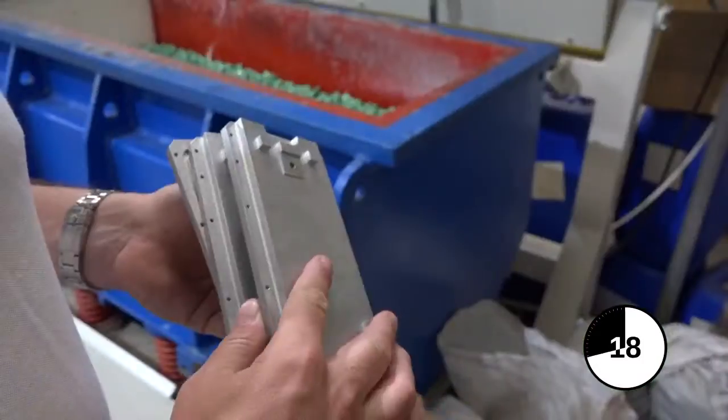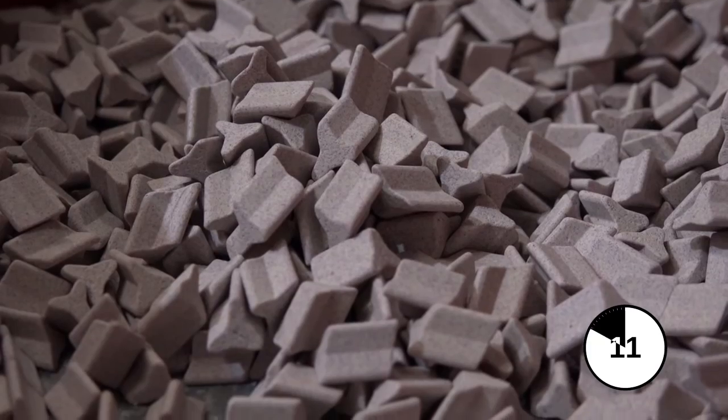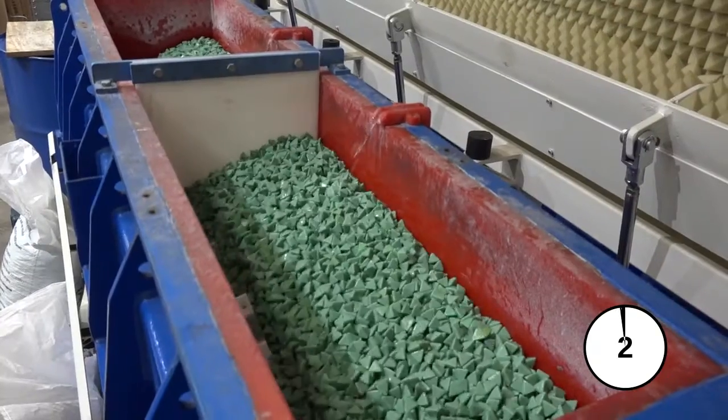You can put various components in here — more than one, you can put 10 or 20. You'd probably turn the machine on for an hour or maybe two hours, and at the end of it you would have a fully deburred part that's ready to go on for anodizing, for example. That is what a rumbler does.